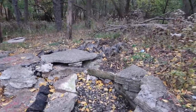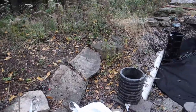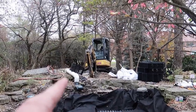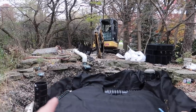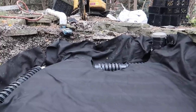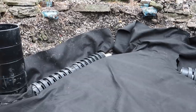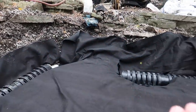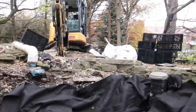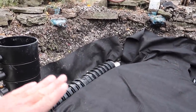So this is our wetland filter. We've been fixing up some of these edges, came in with some heavy-duty fabric, fixed up some rocks that had moved. We've reconfigured the main eight-inch line coming in, split it off into our snorkels and centipedes on this side. We have new cleanouts put in. Underneath, on top of the liner, I put in some stone fines to level everything off really nicely and evenly. So when we put in our aqua blocks it'll be nice and level going across. Our next step is to come in with a bag of cobblestones to lock all this stuff up and make it nice and level.